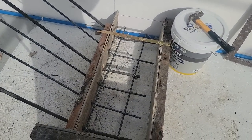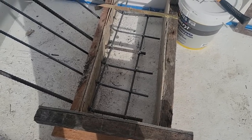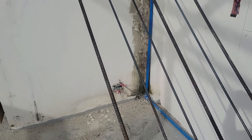And then I tell him to build this base right here, this box, but it's not drilled into the concrete. And to pour this base, and it'll be kind of heavy. And then from there, to run his steel up and to go ahead and bring it up right here and go ahead and drill into this sidewall where the water tank's at. And he's doing a really good job. He's doing the way he knows I like it, putting marine epoxy around the steel, shoving it in so that it'll hold and lock that in.